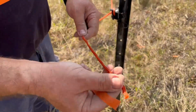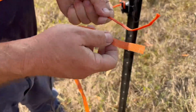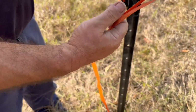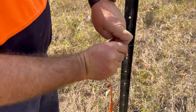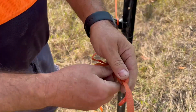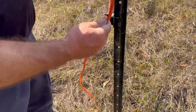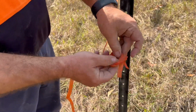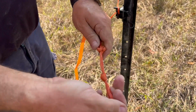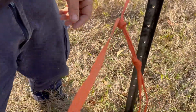This nylon electric fence has come to an end. So there are connectors that you can buy to connect these together, but for today, I'm just going to do a bit of a tie, just to tie them together, and that will get us out of trouble. Put a couple of these in here and it should be enough not to have too much loss on the connections. As I say, there is wire that goes along this nylon. So, with a bit of luck, that'll be fine. Now we'll continue.